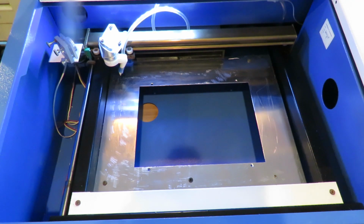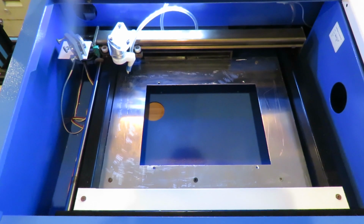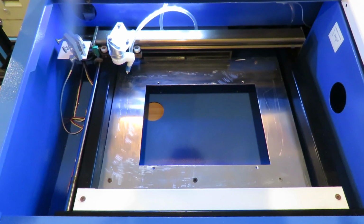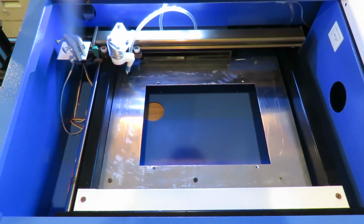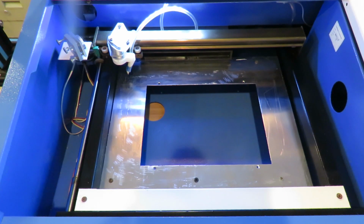I used my Chinese laser to cut a lot of 1/8-inch birch wood. This cutting leaves a lot of dark, brown, tacky cellulose residues on the cutting bed. I recommend using Awesome Orange because it dissolves away this residue surprisingly well. If you have stickers or other adhesive tacky materials such as more masking tape, you will need Goo Gone. As amazing as Awesome Orange is, it will not dissolve the tape adhesive. Make sure your cutting bed is clean.